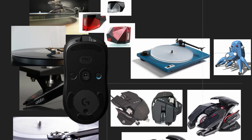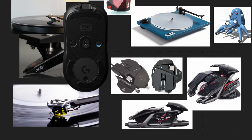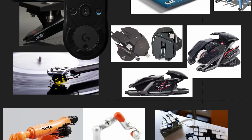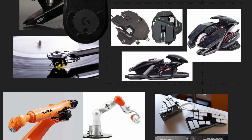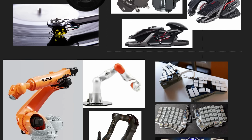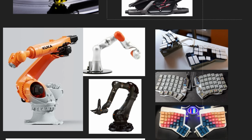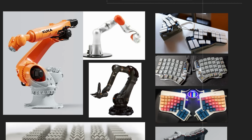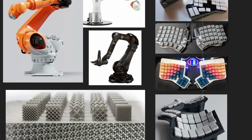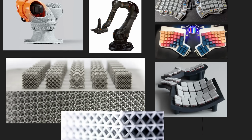As I moved through my mechanical CAD work, I started putting together a style board for the project. This is just a collection of images and reference pictures for the styling of the product. In a normal commercial project on an industrial design team, you would usually do the styling first and then refine design concepts that would get sent over to the engineering team to implement last. In this case, the mechanical engineering is so integral to the design that I'm doing that first and the styling absurdly late in the process. I actually find this to be a better way to work in many projects because it makes it so the mechanics and styling are playing off each other, creating a more unified and interesting product.